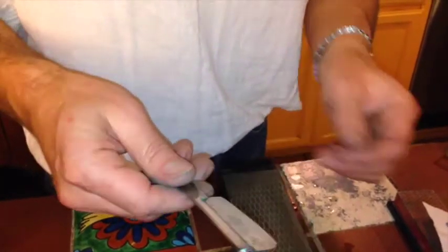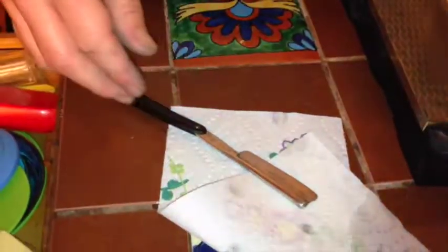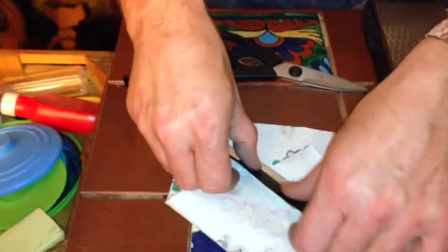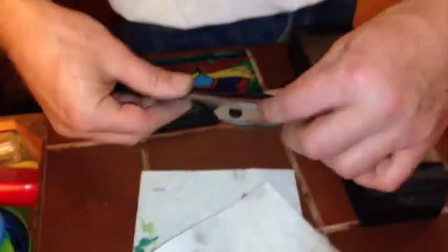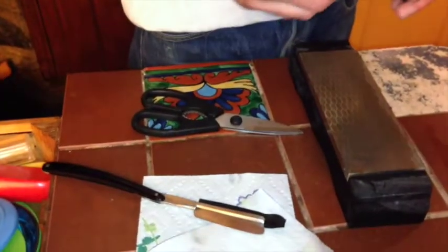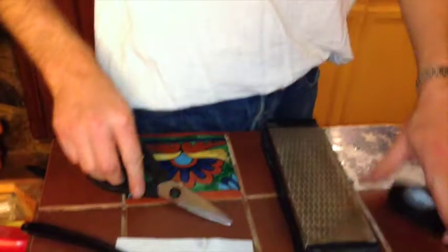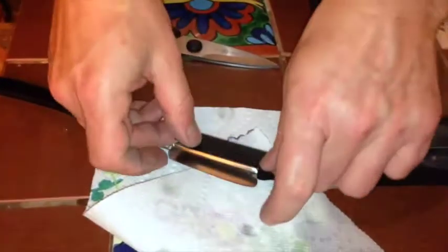It needs a new bevel. So even though it's a frame back, I'm still going to tape the spine because setting the bevel can take a lot of metal out. Because the spine is actually large, I'm using two tapes, one on each side. Typically I just put one, but on special occasions, when the spine is large, I put two. Alright, join them at the top.